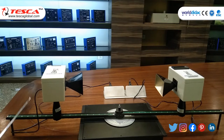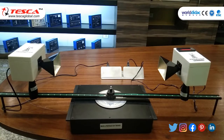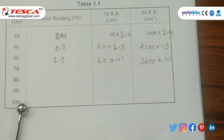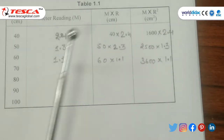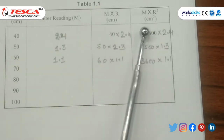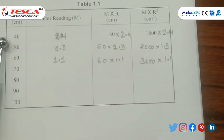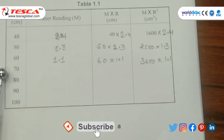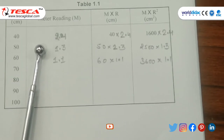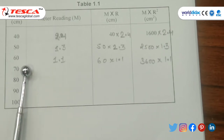After that we have to keep the distance between transmitter and receiver unit about 20 inches — the meter reads 1.3. Now at 24 inches, the meter reads 1.1. We make a table where r is the distance between transmitter and receiver: r = 40 cm (~16 inches) reading 2.4; r = 50 cm (~20 inches) reading 1.3; r = 60 cm (~24 inches) reading 1.1.